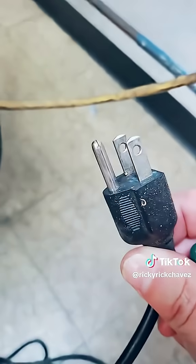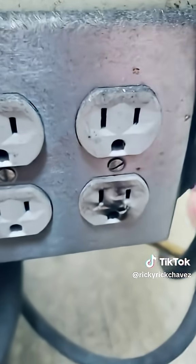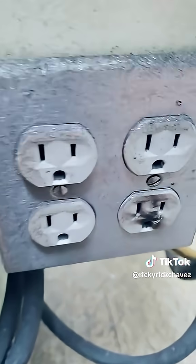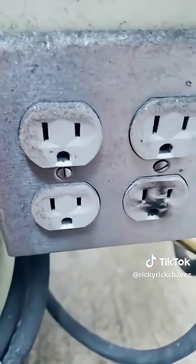But if we look at the plug, you can see a little bit of arcing on there, which really isn't bad. So we're going to have to basically swap out this receptacle and maybe actually swap out the entire box and put in a dome cover box in order for when they're blowing off all this metal shrapnel that these leads aren't exposed. So I'm going to go ahead and get this receptacle repaired, and I'm going to probably think about installing a dome cover box to avoid this from happening in the future.